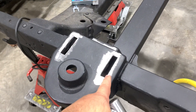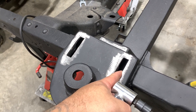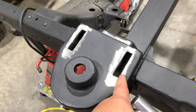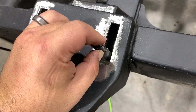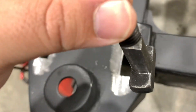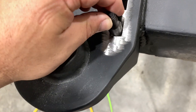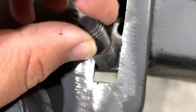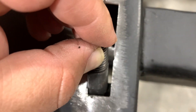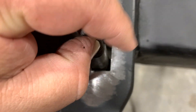Now the T-bolts are kind of loose in there, so I'm going to check it out and might just end up tacking in a very thin sheet of steel on this side. Yeah, I'm definitely going to have to tack in a little piece of metal here because these bolts are not round — they have a shoulder on them so that when you put them in and turn them, they can't turn. I'm going to get about a sixteenth inch piece — an eighth would be too big — just a little piece of sheet that we can weld in on this side.